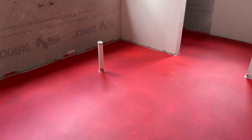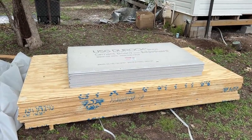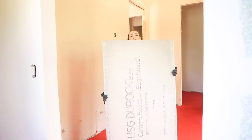So today is plywood and tile day. We ordered 25 4x8 sheets of plywood and also 15 of the concrete. A necessary but ridiculous step we have to take: since we are putting half inch plywood down to build a subfloor and also raise the floor up to the old house, we also have to raise the concrete up for the tile so that all the floors are the same level. The sheets aren't very expensive, so it's okay. I think they were around 9 or 10 bucks. So it's not a crazy investment, but it's still something we have to do.